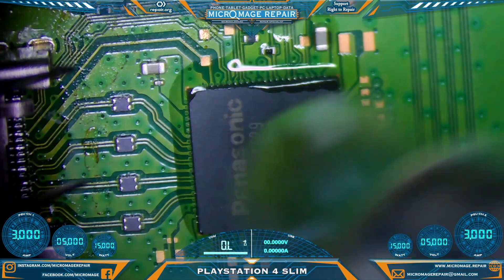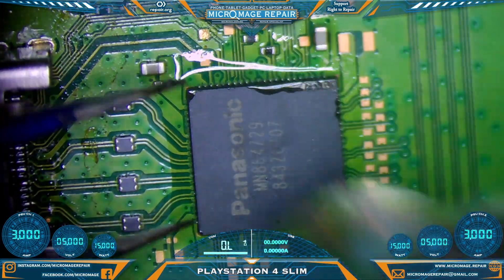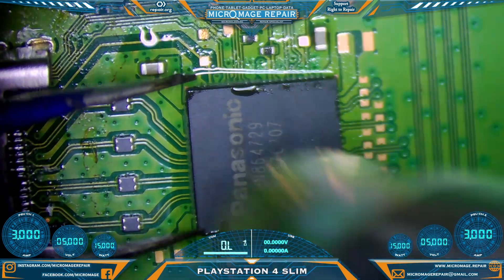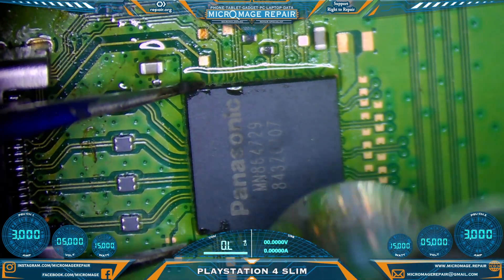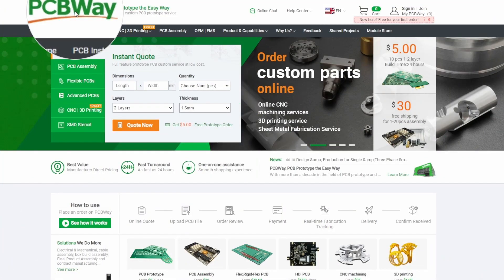Let's get pulling this board. We do have to take some care because this HDMI port has been reworked, so it has a lower melting point. I'm trying to drag the heat as far away from it as I can, but it'll probably wet — as long as we don't bump it we should be okay. One off.